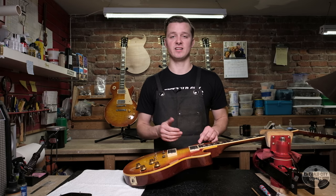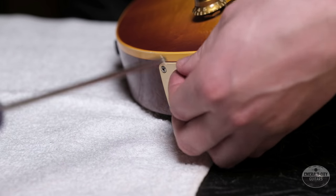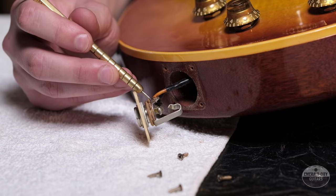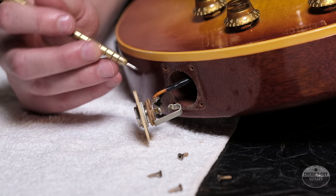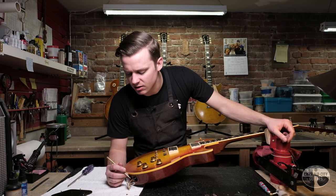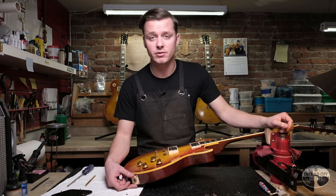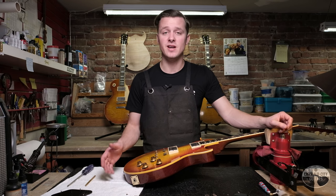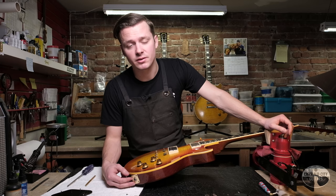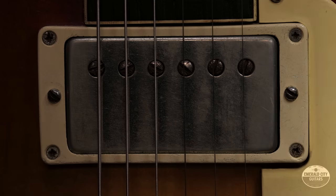With the switch plate off, we can look at the jack — it's a Switchcraft jack. The really telling part is the brown fibrous wafer material that makes up the insulating portion; the new stuff is lighter and less porous, while the old stuff is more orange. This looks like original solder joints — exactly what we want to see. The jack plate has pretty rounded corners; sometime in mid-to-late 1959 they started transitioning to a jack plate with sharper corners, so this is probably pretty late for this particular style, but otherwise looks totally correct.